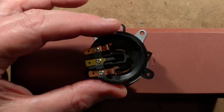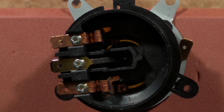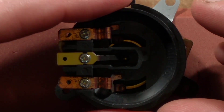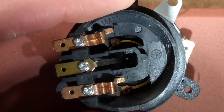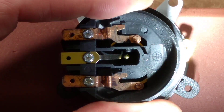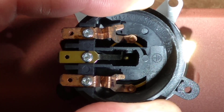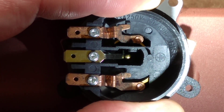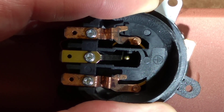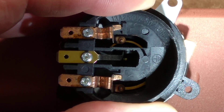Let's zoom down on this and focus. As I press this down, you'll see that these contacts here are sort of folded to give them a certain springiness, and as I press it down they ride up on those brass slip rings. The middle pin is just coming up against the earth pin — it seems to be a low priority. Those contacts are doing the bulk of it, and in a sense they are making a really solid connection, and because they're actually sliding backwards and forwards, they're effectively a wiping connection.